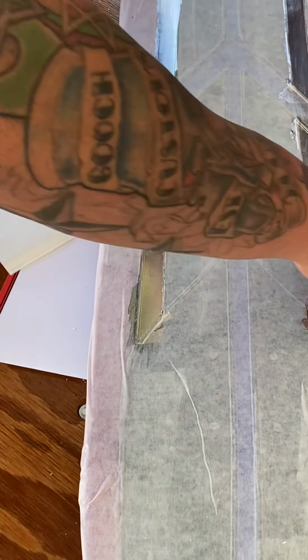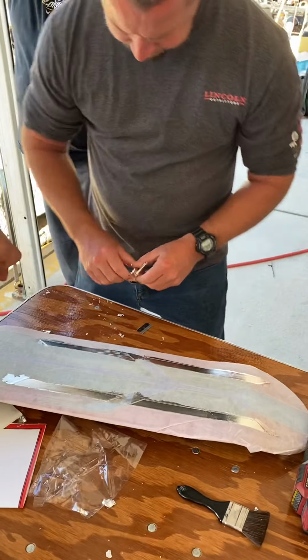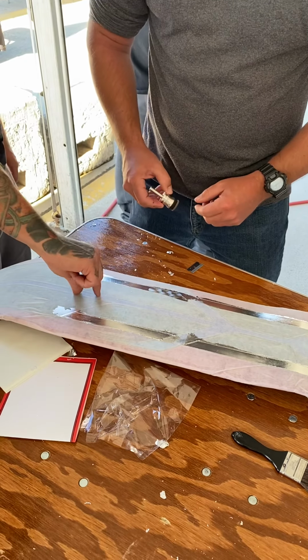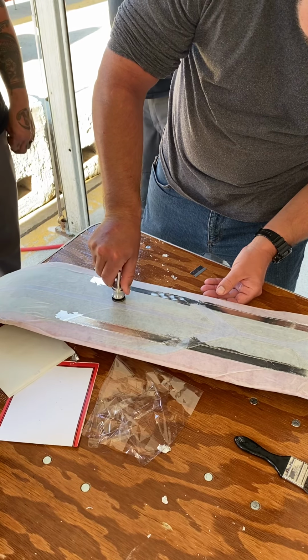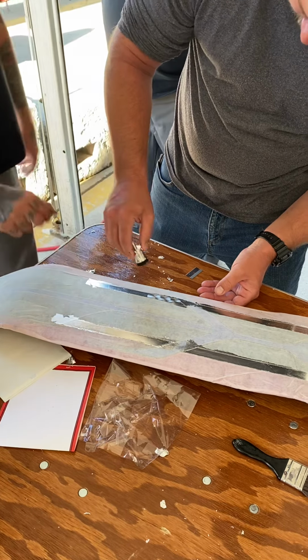So you just give it a slight overlap. Just like that much. And do a little over a quarter of a turn, maybe half a turn. Try to practice out here so that you can make sure you keep that center in one spot. Perfect, right there, that'll work. You just don't want it walking while you're turning.